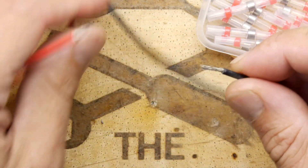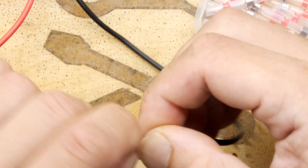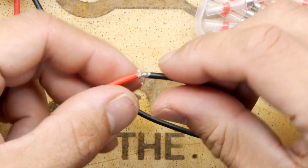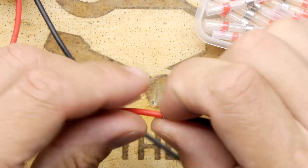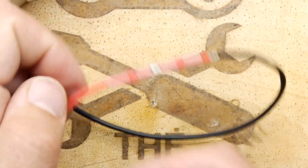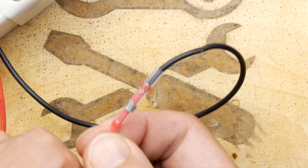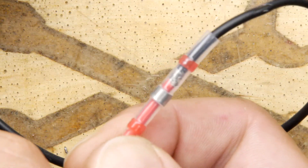Then you get your other end and you hold them like that and give them a little twist. You're basically twisting them around each other, making a normal little splice like that — you could put a blob of solder on there and some regular heat shrink and that would be done. However, that's always a bit of a faff; you've got to get the soldering iron out. So instead, I'm pushing this back over itself, and you can see the black and the red quite clearly in the tube, aiming to get the wire lined up with that piece of solder.